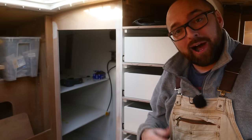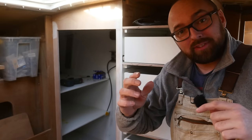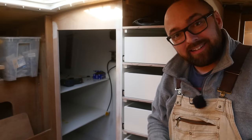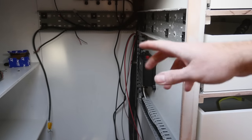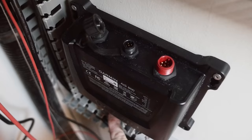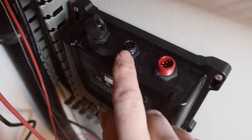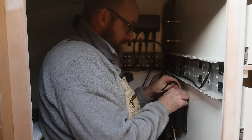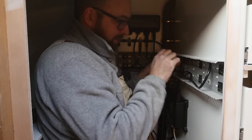It is, and I kid you not, a few hours later. I ran all of the cables in here only to find out that I had gotten the NMEA 2000 cable the wrong way round, so then I had to rerun that, which turned out to be a right pain in the behind. Copious amounts of swearing and cursing later, I've now got all of the cables with the right ends at the right places and I've also mounted the AIS transponder. I've already connected the antenna and the connection to the VHF radio, so now I just need the power cable and the NMEA 2000 cable. The AIS transponder and the radar and most of the other stuff in here is going to be controlled by one of those digital switching boxes, so for now let's just get it loosely connected and tidy it up next week.